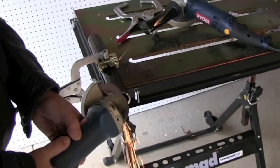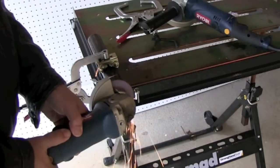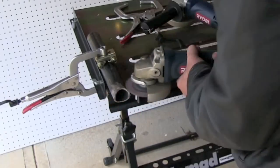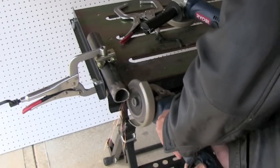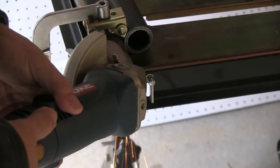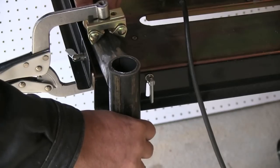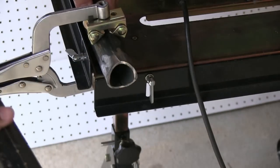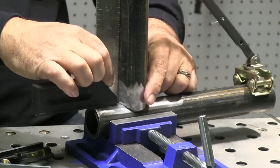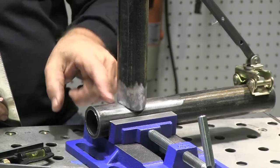It's about 0.166 wall, so that's somewhere around 5/32 of an inch — probably about four millimeters — and I'm cleaning this up with a flap disc. Going to do some final tune-up on it to cope the fish mouth there so that I won't have any big gaps. Eyeballing it and that's close enough. Then I'll clean all this hot-rolled coating off the pipe because for TIG welding you want it clean. Scratch start or not, you definitely want it as clean as possible.